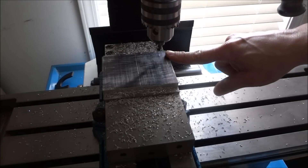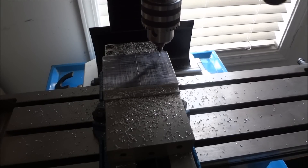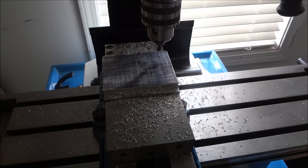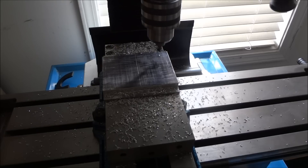I've got my first hole lined up with my drill chuck in the mill. I have a center drill in here and I'm going to use the quill to make a center drill mark, then come back and drill through with a quarter-inch drill bit. I'll drill this, raise the Z axis up without moving X and Y, insert the drill bit, and make sure I get in the same hole. The Precision Matthews is on H1 — high — which is about 600 RPMs. That looks good.